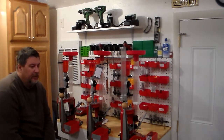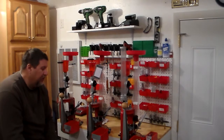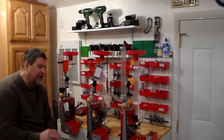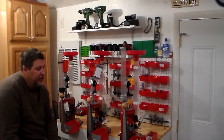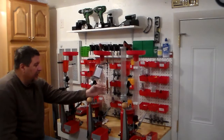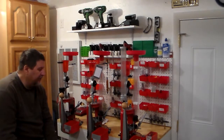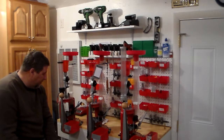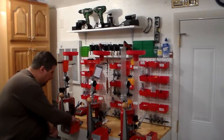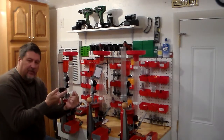I'm going to show you how to make a piece for the press — a lot of times when you're reloading rifle calibers, the brass has a tendency to fall over. My case tubes are special; they've got different components inside that prevent cases from falling over as they come down. I'll also cover changes to keep case tubes from getting wobbly, warped, or bending. And I'll show you another device I made — a paddle or clip that moves and rotates toward the case as it travels into your shell plate.